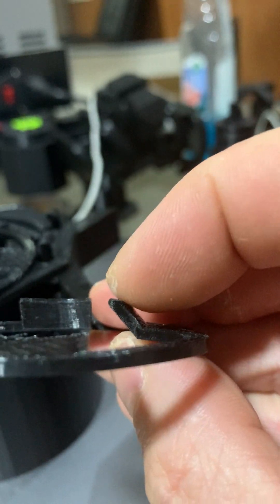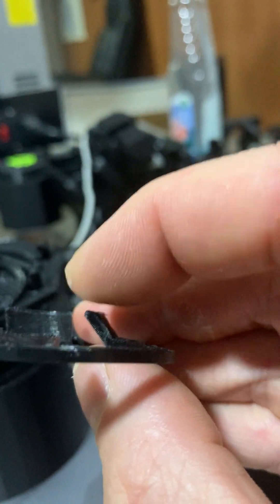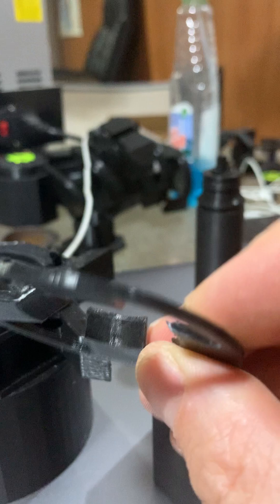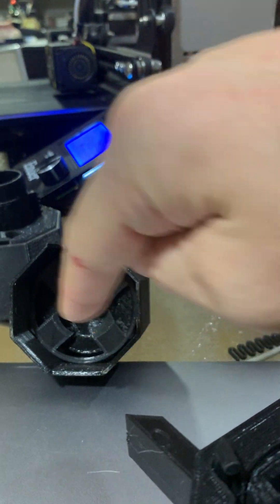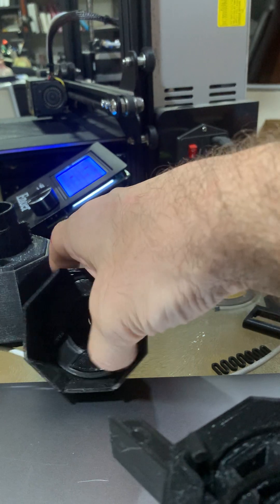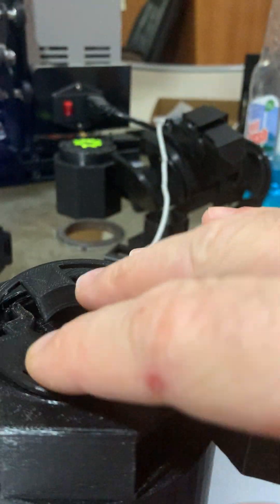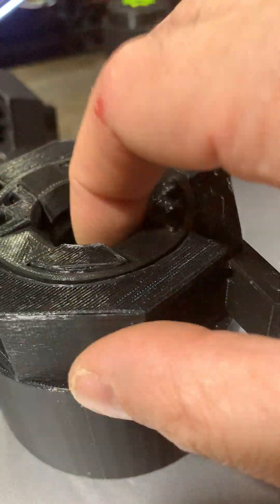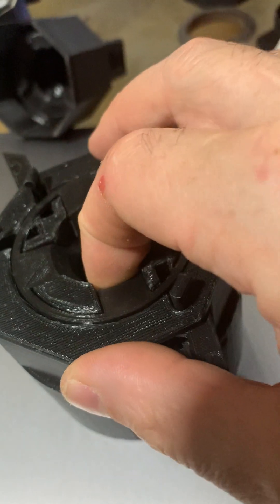You can see how these things broke off from repeated use — they were breaking off because the thicker piece meant higher bending resistance and more strain on these. So the horizontal one is now thinner and this one here is thicker so that shearing doesn't happen again. The tolerances on either side were tight, so I basically loosened that up. Now when I put it in it doesn't rub, doesn't make any real noise, it just pops right in — nice and smooth.